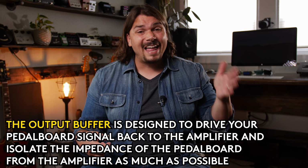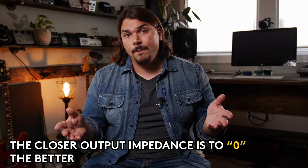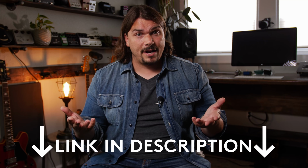Equally, on the output, the important part of having a buffer last is because we don't know about all the different specs of the pedals on the pedal board. Some of them can be as low as 100 ohms, although rarely, and most of them are more commonly 1K or above, which is not an ideal specification for driving long lines. Technically, the closer you are to 0 ohms on the output impedance, the better it's going to be at driving long lines. So there's certain buffers that I recommend in the description that are great at doing that.